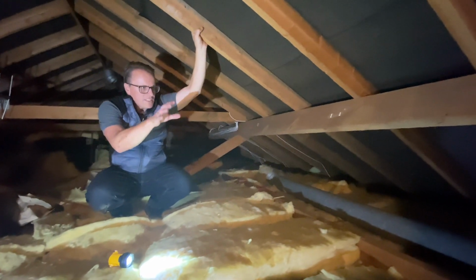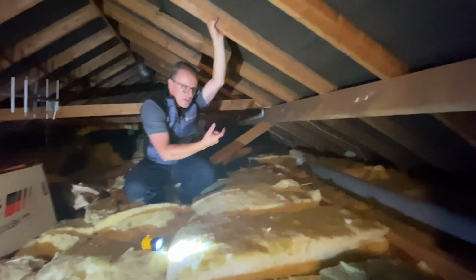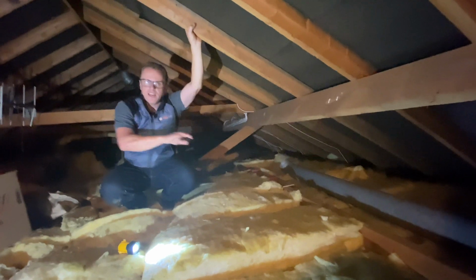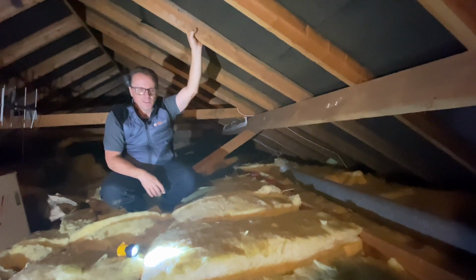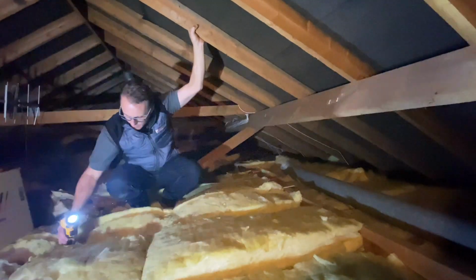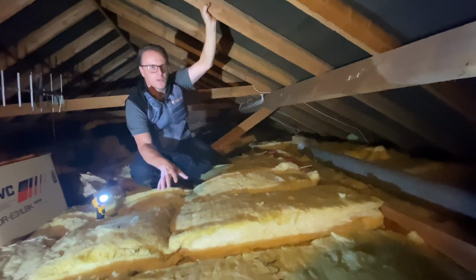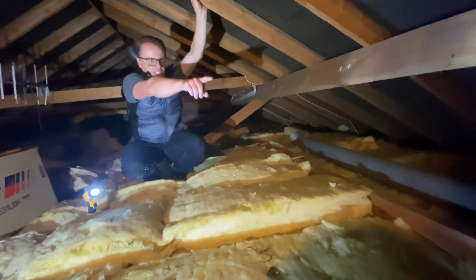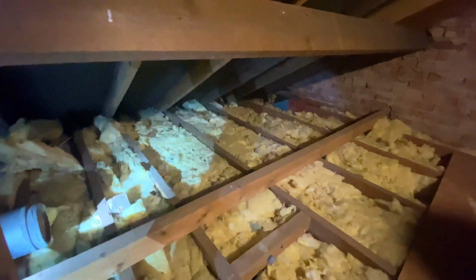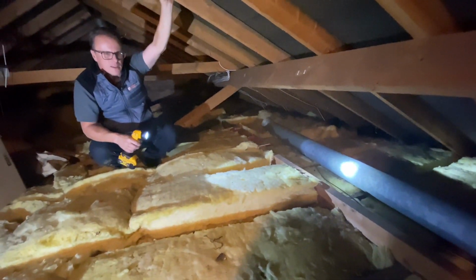We've got our ventilation that we saw outside is not brilliant. Ideally, those ventilation strips would come right the way down the soffits. They'll be on both sides of the property, and they will provide a good flow of fresh air over the insulation. The insulation of which is not great. It's thicker in places. So here we've got probably about 150, maybe 200 mil of mineral quilt insulation. But just over there, Charlie, if you can turn around and show that, we're probably only about 75 millimeters of insulation here. So it's not great. So we would really want this to be about 300 millimeters ish,